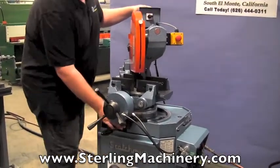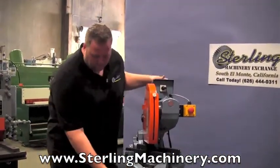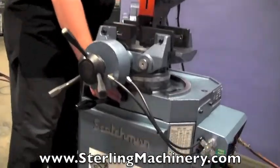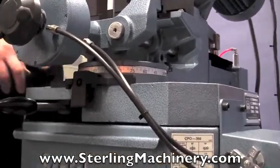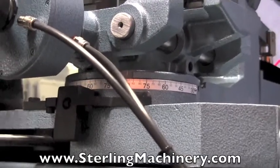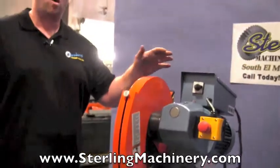You'll see right here is the lock for the head. If you go ahead and unlock the head, it's got a quick pin adjustment for the most popular sizes — I think it's 15 degree increments: 15, 30. When you put it in, you'll notice right there it clicked in. That means you're going to be directly on that 60 degrees. You don't have to think about it, you don't have to look at it — you're right on 60. Tighten it in, make your cut, and you'll have a very nice, clean, accurate cut over and over again.